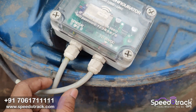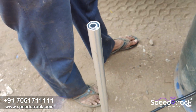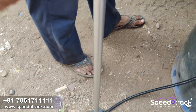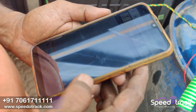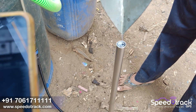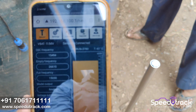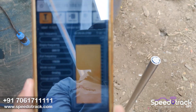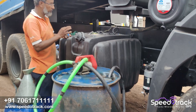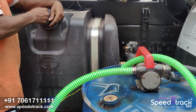After we cut the sensor, we have to recalibrate it with our configurator device and we connect it via mobile. First we take the empty reading and click on the empty button, and after that we fill the fuel sensor with diesel and press the full button. We set the full value, then install the diesel tank and tighten it.